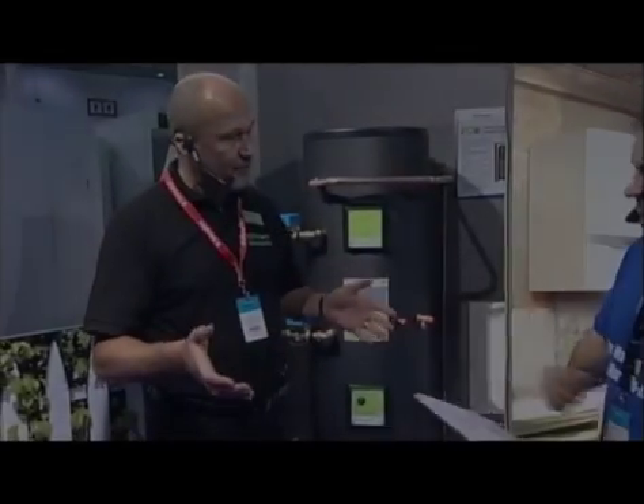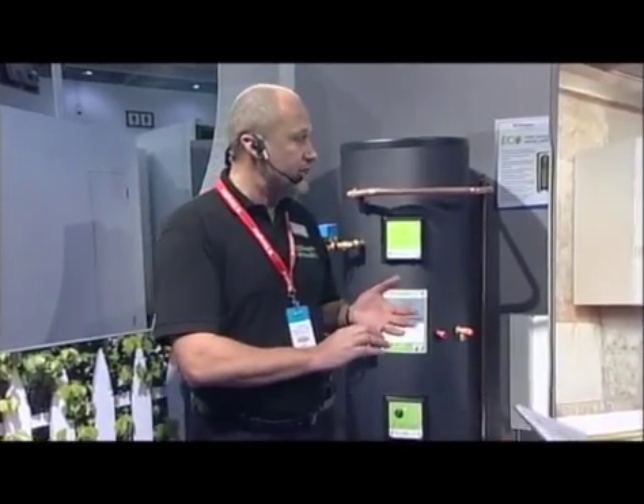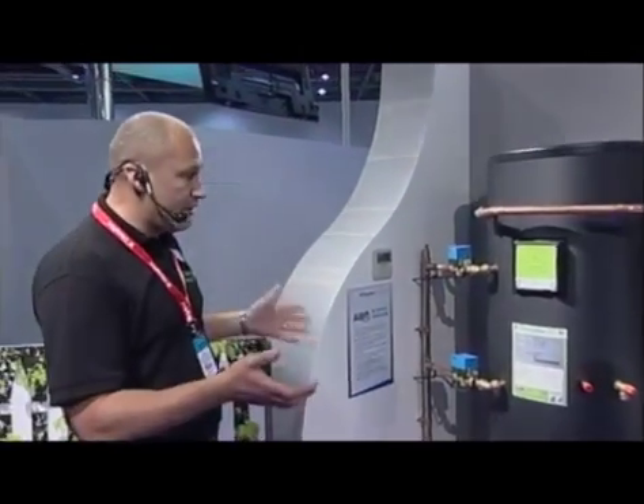The principle of a heat pump and a boiler are readily the same. A gas boiler uses a hot gas through a heat exchanger that transfers energy to the circulating water, whereas a heat pump uses a refrigeration cycle to create a hot gas, which is then passed through a plate type heat exchanger that transfers the heat energy into a circulating water system. There are a lot of similarities between the two.